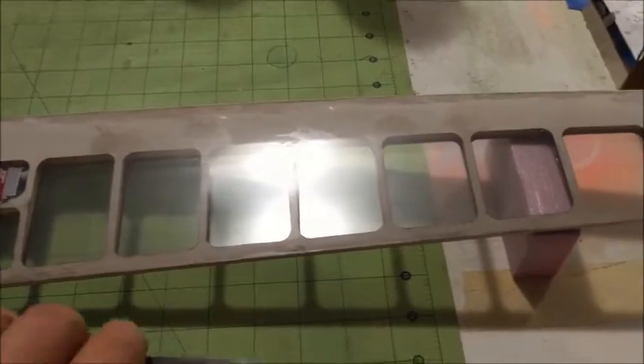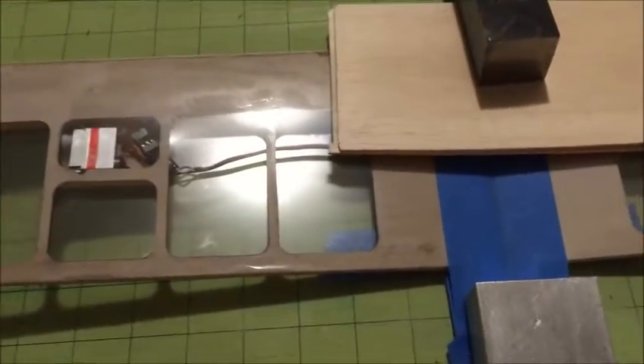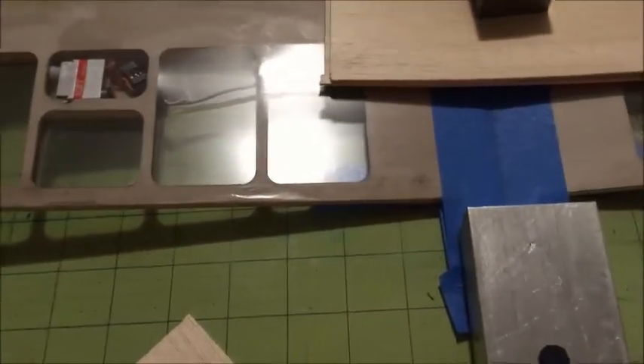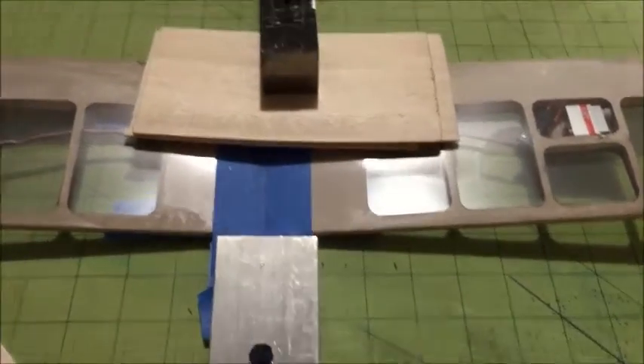I did double-check to make sure I have 19 inches — I measure from the inside of this point to the center line, just to make sure I have 19 inches. This should be good. This is a little bit higher because it's sitting on top of this — see that the blocks are sitting below. You can compensate for that and bring this in a little bit more, and that should compensate for the extra height we have over here.